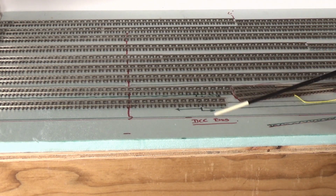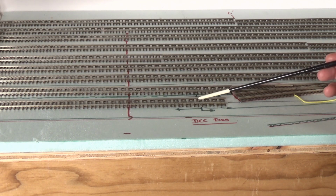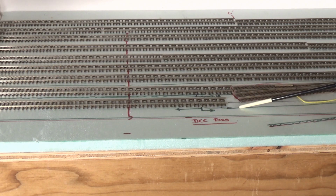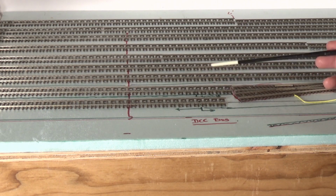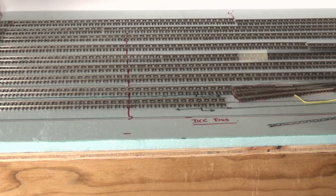Now, as far as the green wires, as I said, the green wires will be controlled by the single pole double throw switch that is built in to each one of the IP digital switch machines, and then that's going to have to come underneath the track and then feed down the ladder to the specific IP digital switch machine that is going to control the turnout that goes to that yard track as well. So I'll have a number of these individual wires. So that's a whole bunch of wires that have to come under the track.